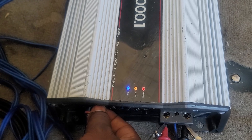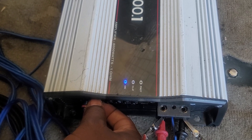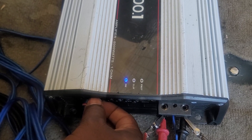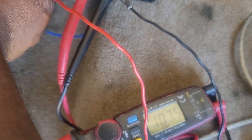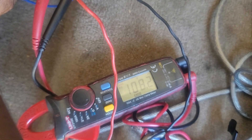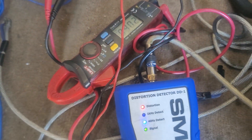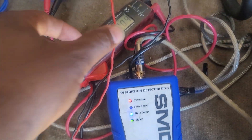See what I'm talking about? Clip. Protect. I don't want this amplifier to get damaged. Instead of just going to clip and allowing me to back off, it goes straight to clip then protect. That's with the amplifier at around 108 volts of output. I don't want to damage this amplifier, so I'm going to go by what this meter says, like I did every other test.